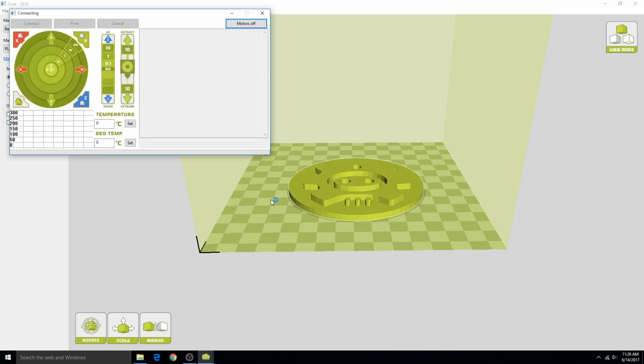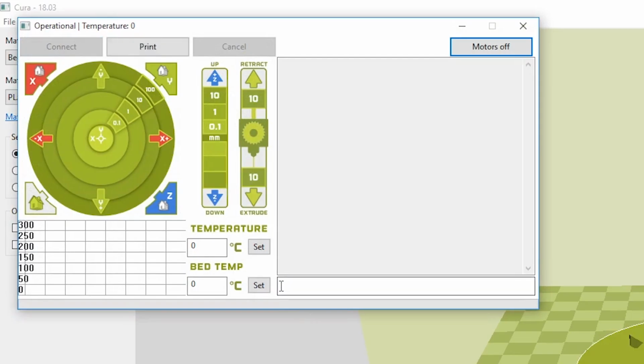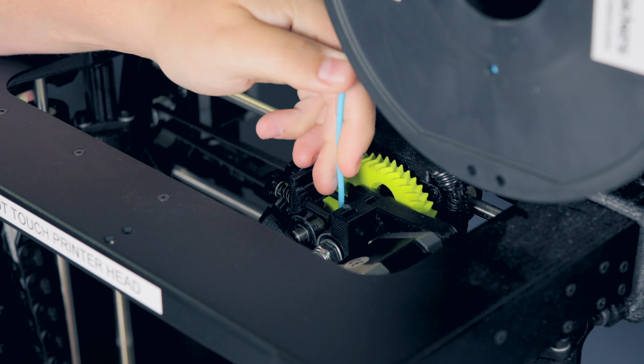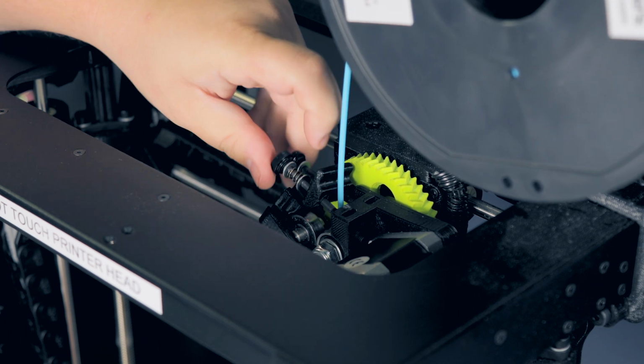A control panel pops up with the controls for the 3D printer. Most aren't important since the Lulzbot will align itself to the baseboard once we hit print. Set the head temperature to 204 degrees. That is the ideal temperature for melting the PLA filament. Once the head has preheated, we can choose our filament and insert it into the feeder. Next, we want to lock it in.